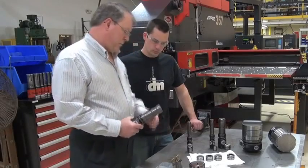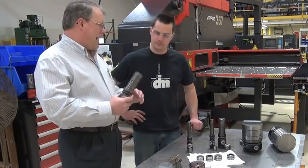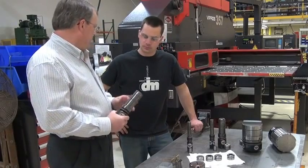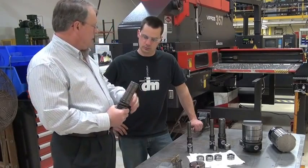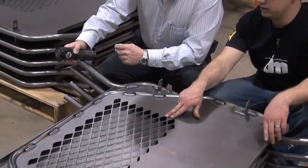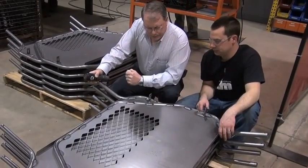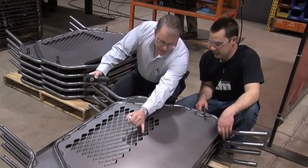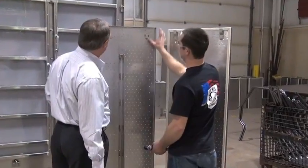Mate's fully guided tool design also contributes to effective cluster punching of stainless steel. Mate's fully guided tooling has a tighter clearance between punch and stripper, making a big difference in rigidity. When punched sheets have more holes than material, the precision of the punch tooling determines the quality. Mate's fully guided tooling ensures burr-free edges and flat sheets when there are more holes than material.